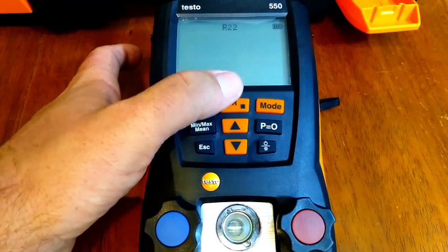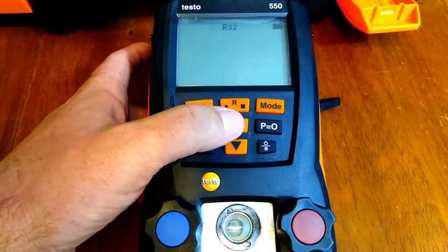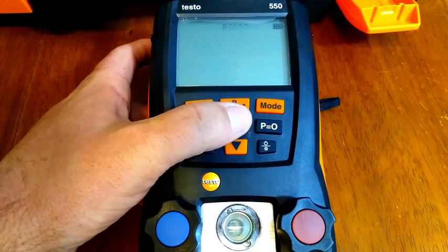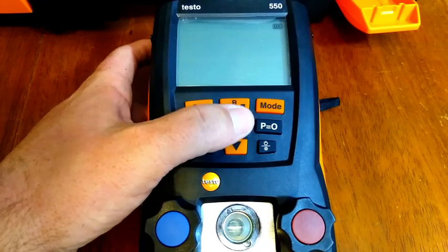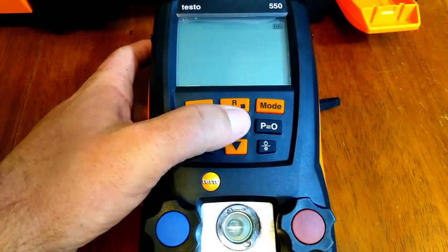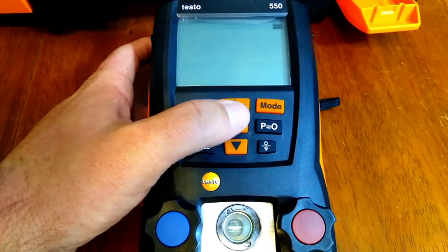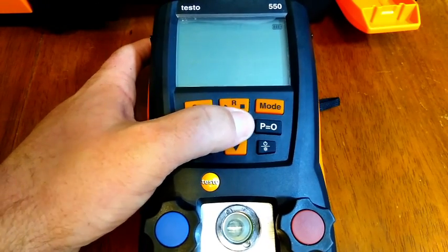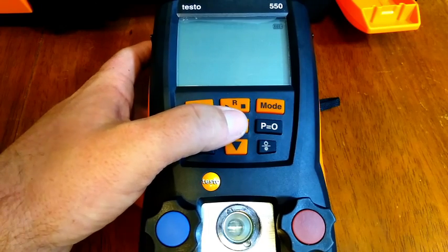If you're choosing refrigerants, you hit the button in the middle and you can see R22 is flashing. It goes through the whole gamut — R32, 404A, 407C, 407F, 410A, 421A, the entire 422 series including 422A, B, C, and D, 424A, 427A, and 438A which is MO99. It even has isobutanes and some refrigerants you'll probably never use, but it's better to have more than you need. It also has water, R11, R12, and back to the beginning.